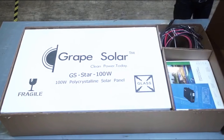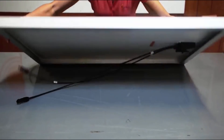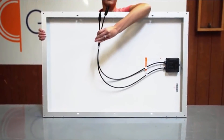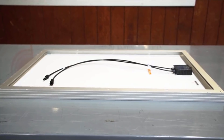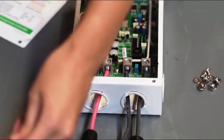This kit is exceptionally easy to assemble and use. The heart of the system is the Grape Solar 100-watt crystalline panel. The panel is designed with industry-standard MC4 connectors used for their durability and weather resistance. The back of the panel has mounting holes which allow you to mount the panel in various ways. Using the included MC4 cables, you connect the Grape Solar panel to the Xantrex C35 charge controller. The cables include an MC4 connector on one end and a bare wire on the other end, which connects to the charge controller's terminal block.